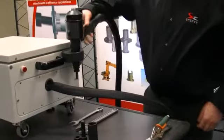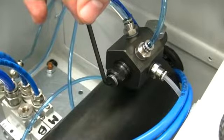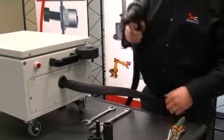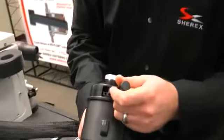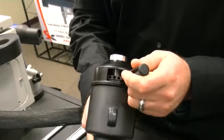The Flex 18 is able to do this by offering a pull to force valve within the tool that you are able to adjust. The pull to distance feature of the Flex 18 is adjusted by moving the stop lock at the back of the tool. You move it in and out to change the distance that the tool will pull back to install the rivet nut.